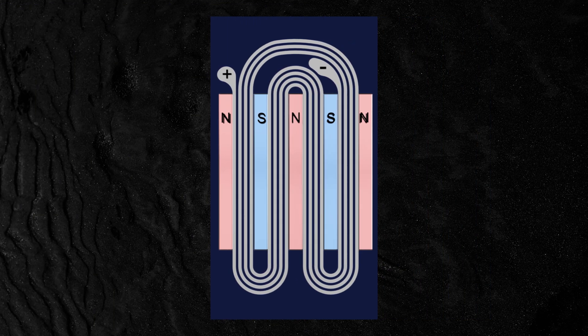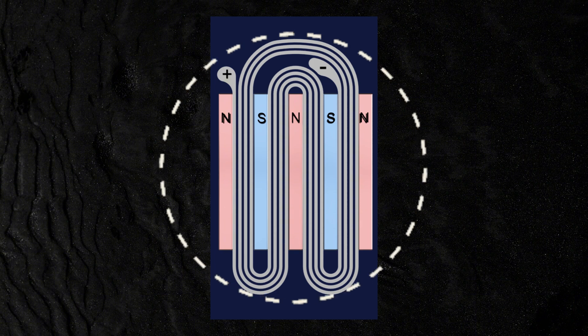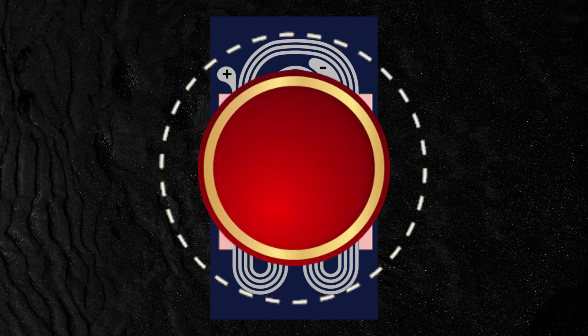Let's take a look at this coil and try to understand why it is so inefficient. Imagine that this is the size of your headphone. You have stretched the coils to the edges of the headphone, and if you want a circular membrane, this is the largest one you're going to be able to make, since the connection points have to be outside the moving part of the membrane.